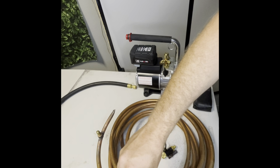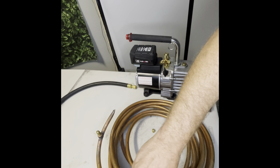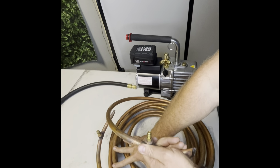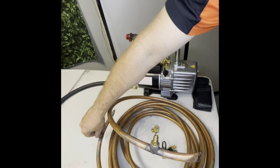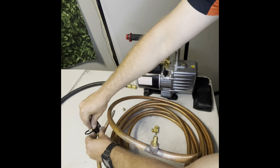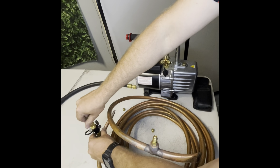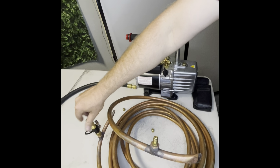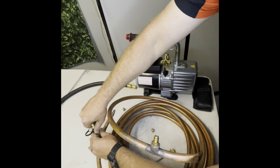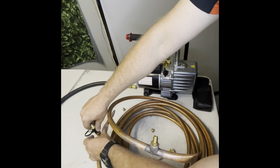All right, we got that out of there. I'm gonna put my micron gauge on this end so that way it can be seen a little bit better. And I'm gonna bend this up so the camera can see it with the micron gauge. And I'm gonna pull the core out of this end for our vacuum pump. This is how we're really supposed to be pulling vacuum, guys, is pulling the core through a core removal tool. Didn't quite catch on. All right. So we pull our cores to the core removal tool,